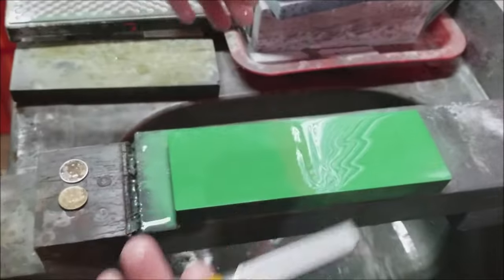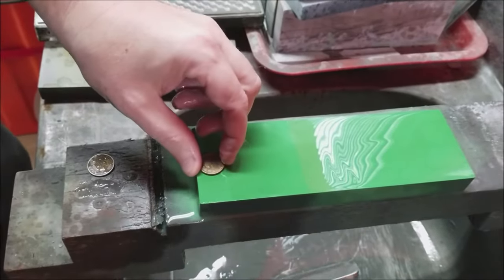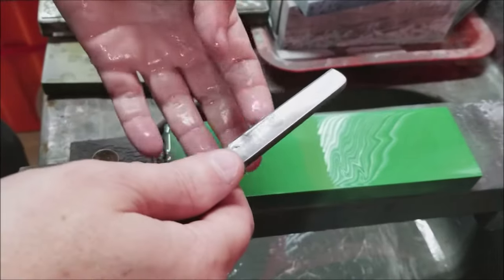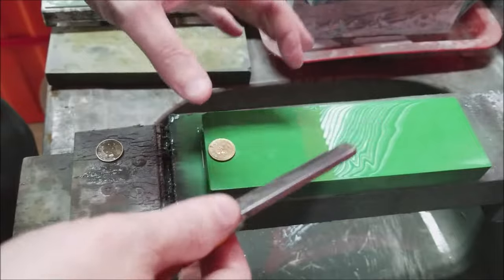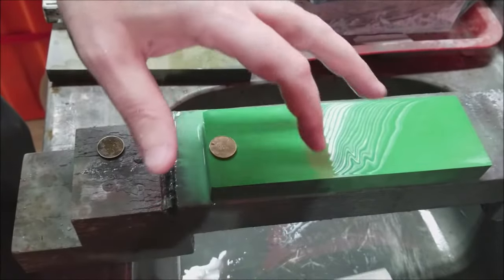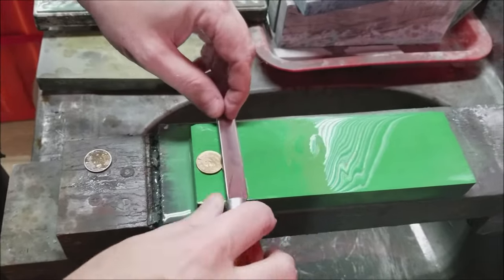All right, so the remainder of the stones, we do everything the same except our first dime angle, or our singular coin, does not need a burr in the first round because we have the shape. All we're going to do is color in the lines that we've made with the coarser grit stones. There's 1,000 grit, and I'll just move up. We'll do a quick montage here.